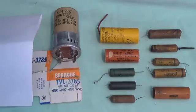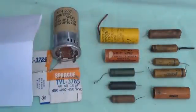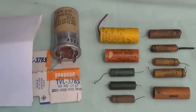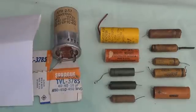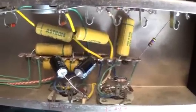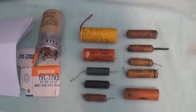Let's take a few seconds for a cautionary tale. In the bottom of the amp cabinet was a sack labeled 'Gibson Old Replaced Parts,' full of capacitors including a large Sprague twist-lock cap. I have an itchy feeling that at some time or other, these capacitors were presented to the customer to justify a rather high repair bill. Also in the bag was the invoice for that splendid job on the electrolytic capacitors. Now, let's look in the chassis — you're going to see that not a single one of those components in the bag was ever in this chassis. They're not the same vintage or style of capacitor. So just keep that in mind next time you're presented with a bag of old parts and told they were removed from your amp — maybe they were, and maybe they weren't.